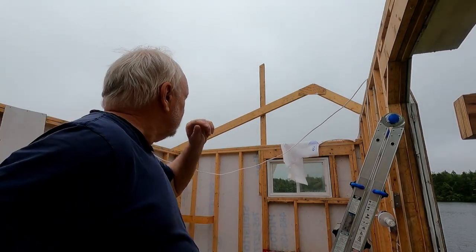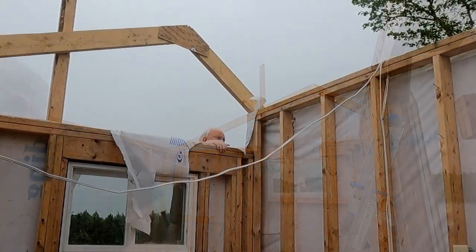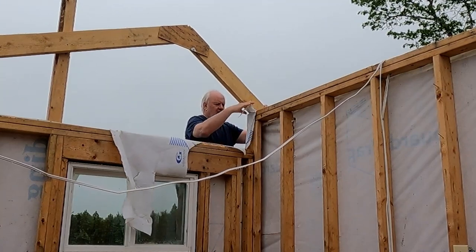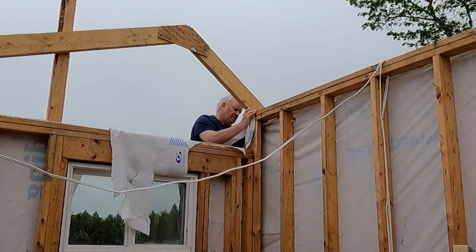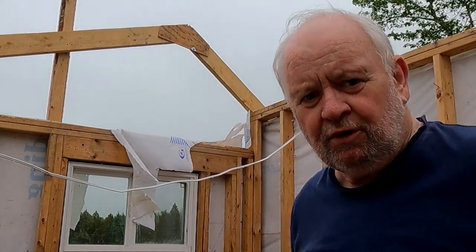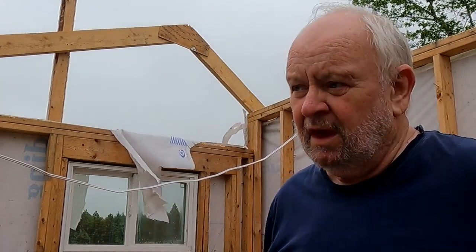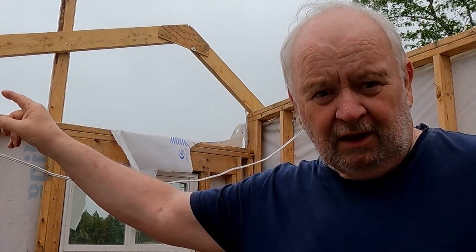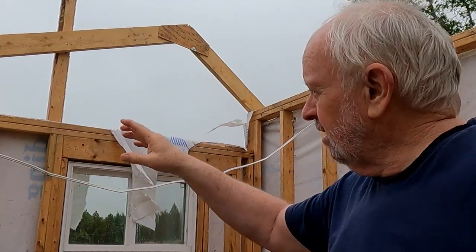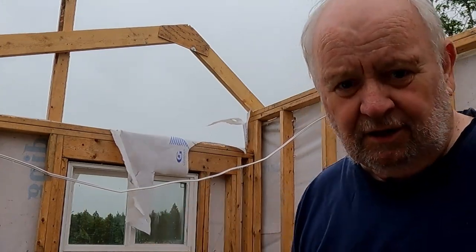It's not sitting right down on the right-hand side, but I think we can make an adjustment. The truss was about a quarter of an inch off, so I cut away the paneling on the left-hand side to let the bird's mouth sit right on top of the plate — sit over the paneling. When I did that it moved the truss to the right and it fits good up here, so now I'm going to toenail that in and start to plumb it up.